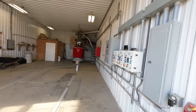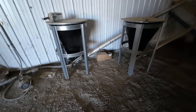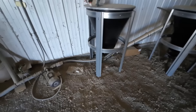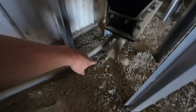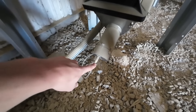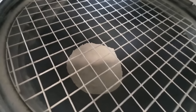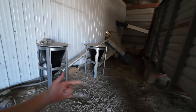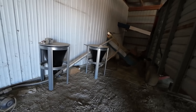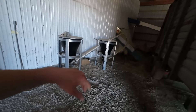All of the ingredients are loaded based on weight except for two of them — these two small mineral bins. These are actually measured based on a pulse. They're a flex auger just like out of the big bins, except there's a sensor right here that reads every rotation of that auger. These have to be calibrated with the mineral you're using so it knows how much weight you're going to get per rotation. It'll call for a certain number of rotations versus a certain number of pounds, since some of these ingredients are put in very small amounts — like little heifer batches.